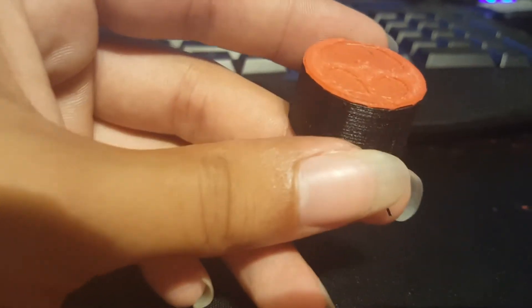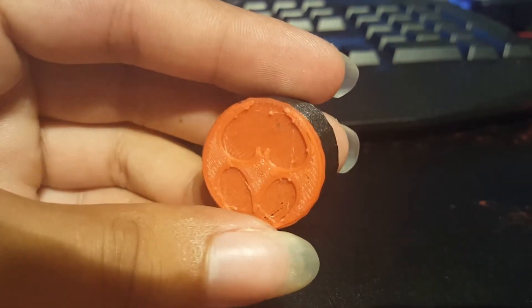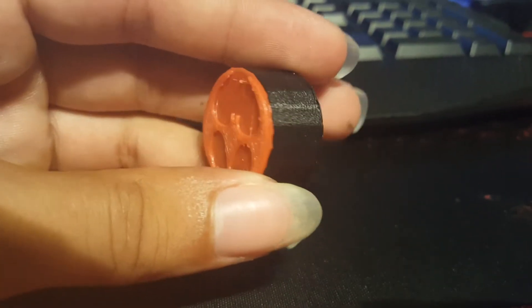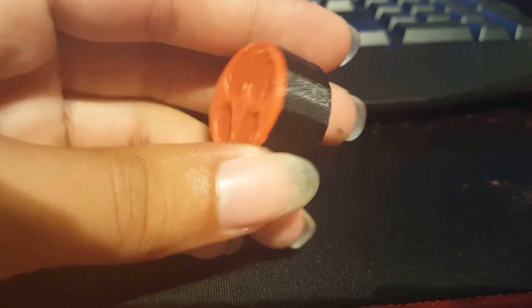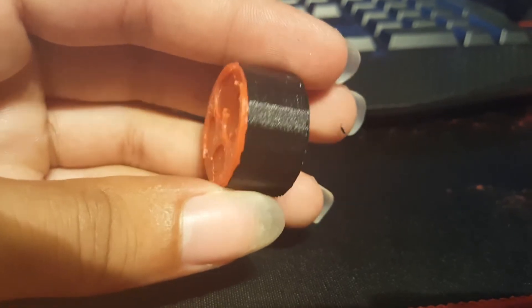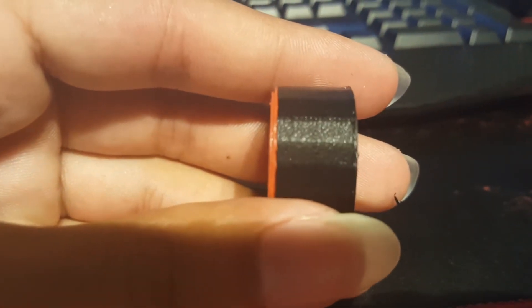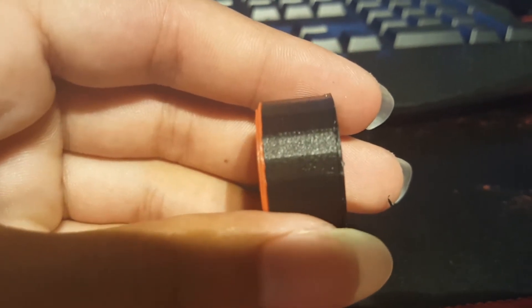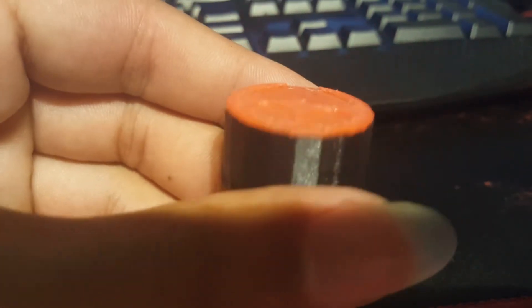This is it finished. It didn't come out so bad, but this is my first time doing it. Next time I know for sure that I will have it start a little before this top area. I just feel like I would have more finer detail in my red like I do my black right there if I would have started it just a few layers lower. Because I started this layer at 70, and it only has 76 layers total. So that's just a good note for the future. But other than that, it came out really well.